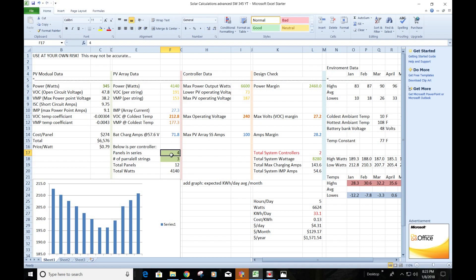In my situation, it only freezes like this maybe three to five days a year, and it only cuts off for about half an hour — so you're looking at two or three hours of downtime per year. I wouldn't go down to three panels in series because you'd lose a ton of power by only having nine panels instead of twelve. But for your area, if it's going to be really cold often, you should probably design your system to stay under 187 volts under the worst-case scenario.